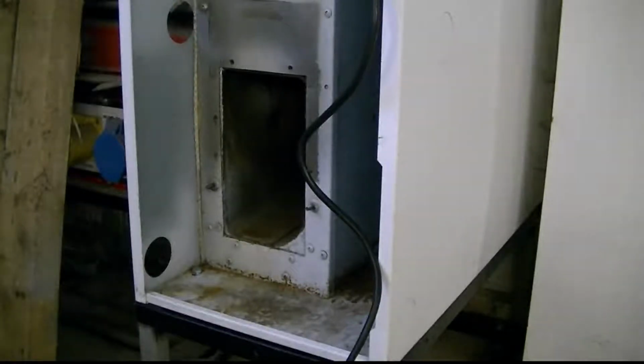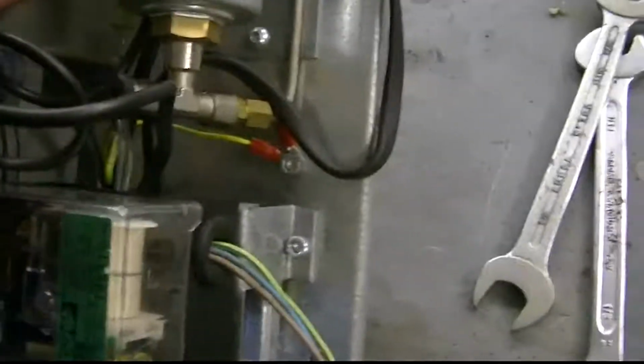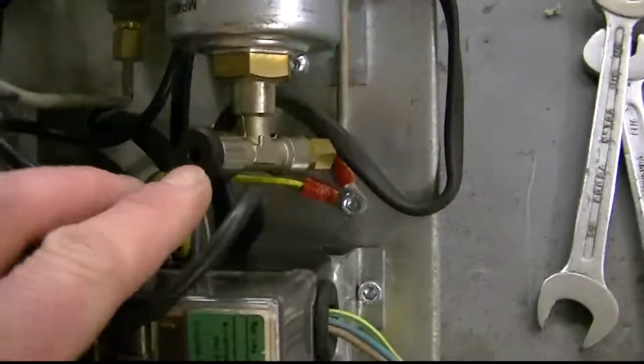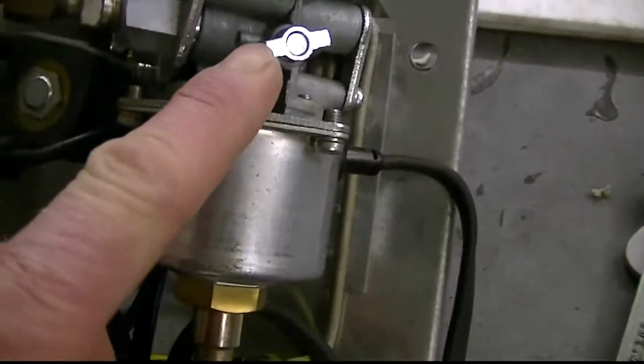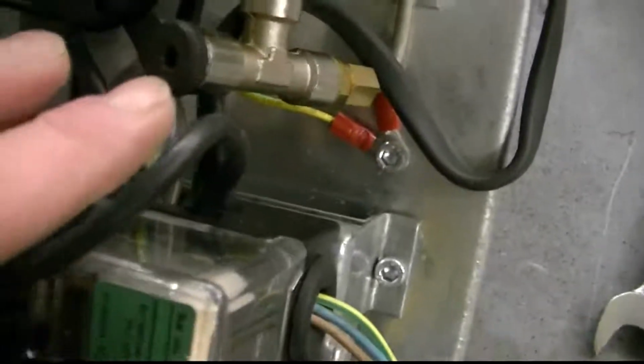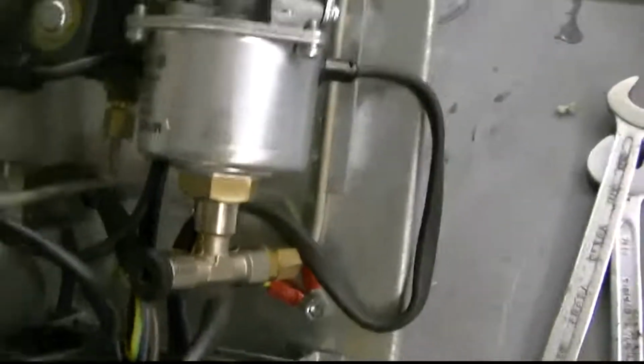The other thing, this burner, now I've had my old house, I had an HRM boiler, and that had the same thing, and you bled it from there. But I've noticed this here is, and I did see some instructions somewhere on the internet about that being a bleeder as well. So do I need to do anything with that, or do I just bleed it via this, loosen it off, wait till the oil comes out, close it off, done? How does it work?